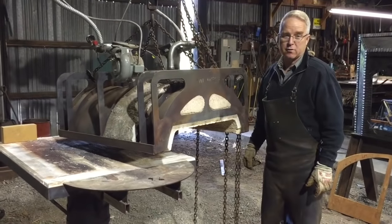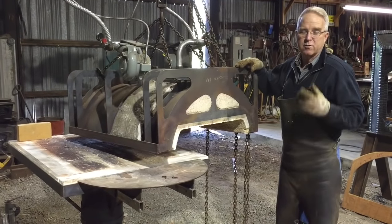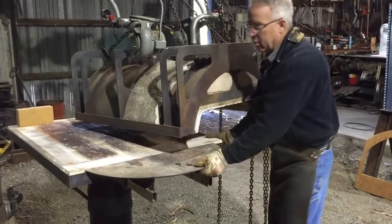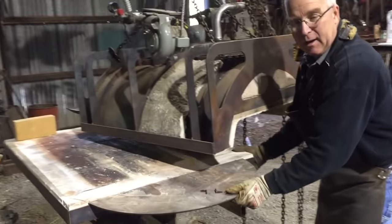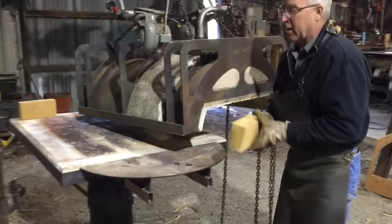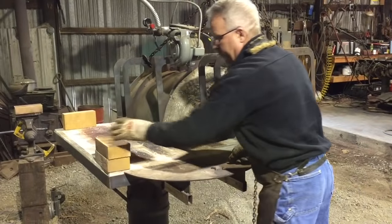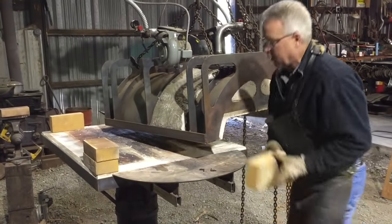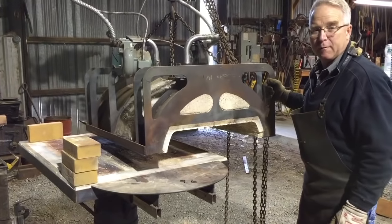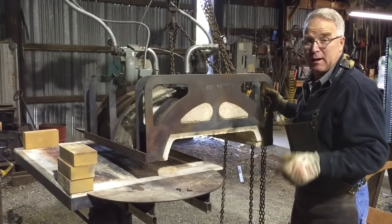Knowing that eventually I would have a crane in the shop, I realized it was a priority to make the forge top-loading and liftable. With this base, which is sturdy enough and able to be rotated to facilitate working from different angles, I can stack fire brick around the perimeter — really as high as I would like — lower the forge onto the fire brick, and create a forge volume that frankly is unreasonably big if I wanted to, perhaps big enough to put an anvil inside of this thing.